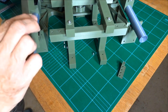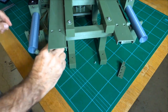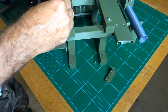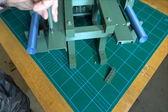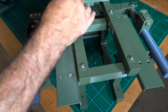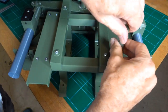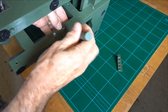Okay, you can put the heel boards on now, so they'll just drop into place. We've got the cutouts for them. Okay, and this time we are using 8mm M4 countersunk screws. They just need a little bit more depth to hold them in to make it through. Once again, you could probably use longer ones if you want. The 6mm ones just seem a little bit too short for this. Yeah, it doesn't take too long. And the only other one left is this final screw here. You could have done that up before, it doesn't really matter.